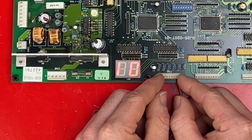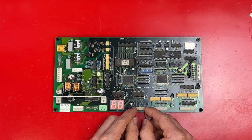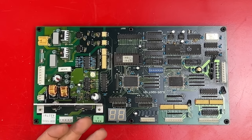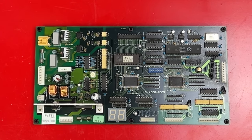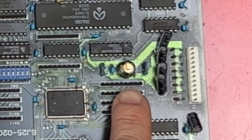After a bunch of searching, I found that the error 7 just means that it couldn't calibrate the steering wheel during self-test. So that tells me that this board isn't driving the motor and not much else. At this point, all I know is that it's not a power issue and the basic brains of the thing are working. What I want to know is whether it's telling the output stage to work or not. And that capacitor is very leaky.